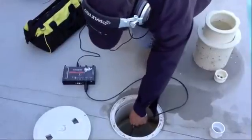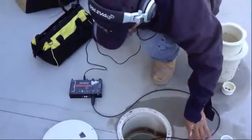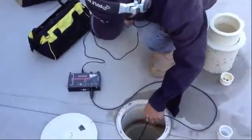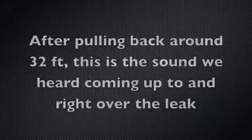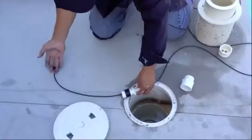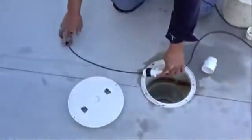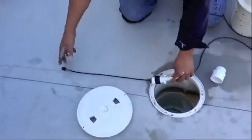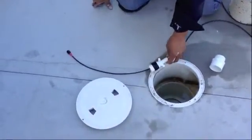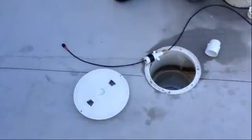What we're going to do is pull it back until we're exactly over it, and we're going to introduce the sound fading towards it and then introduce the sound after we pass it. That's the distance to where we pinpointed and heard exactly what we needed to hear. The direction of the equipment is back that way. We know we have a service loop under the skimmer, so we're going to put an X right where the microphone head is — we're probably within about a six to eight inch radius of the actual leak.